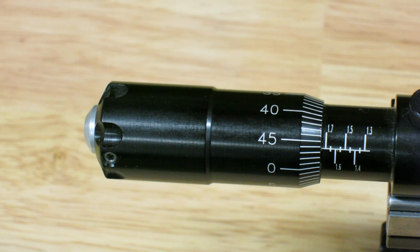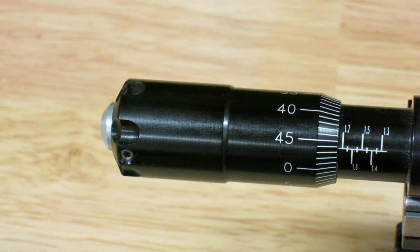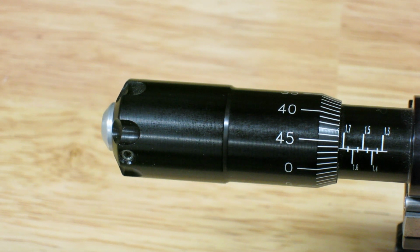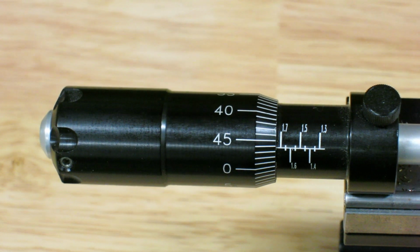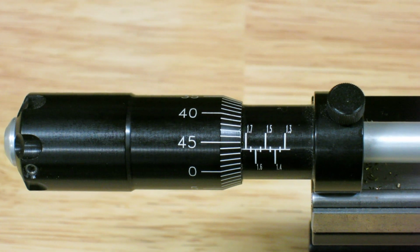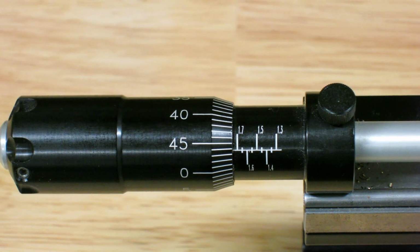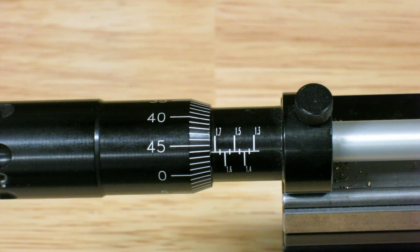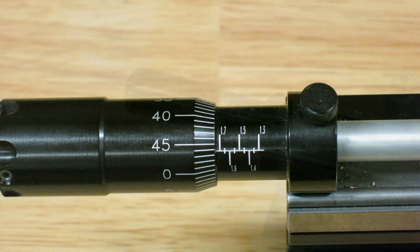The micrometer is adjustable in thousandths, as I said earlier. You'll note the small set screw on the left side there. That allows you to re-zero it according to what your machine actually does. And then, as I mentioned also, it's got a locking knob which allows you to lock the setting in place. This is really nice because when you're switching from cartridge to cartridge, it allows you to just dial the same number that you had previously and you're trimming brass in no time.